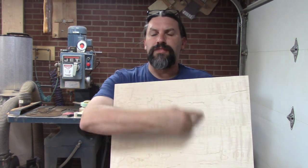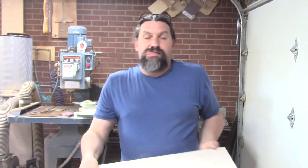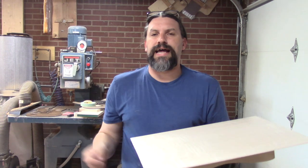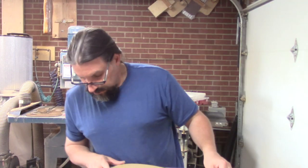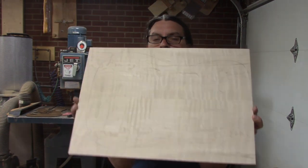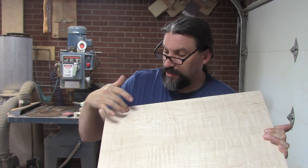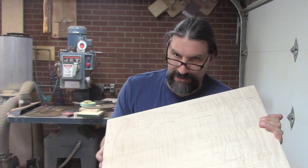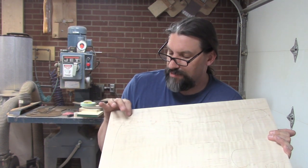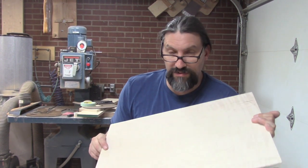Next thing we want to do is lay out the body and rough trim it out. The reason we want to rough trim it is, if we left it square, you'd have to get all kinds of crazy clamp action. So we're going to rough cut it out, get everything centered up. So now we'll go over to the band saw and rough cut this out. Because I'm going to be stretching this part, I want to leave a little bit more on this side — probably about a quarter to an eighth inch everywhere else and maybe three-eighths to a half right here.